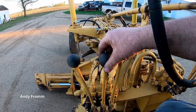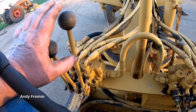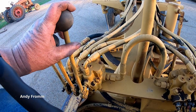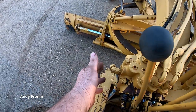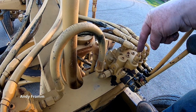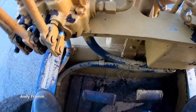The way this machine is set up: everything back goes that way, everything forward goes that way. These valves are different valves from side to side according to the parts manual, and they're kind of interesting. To me it seems like this one is set up for almost like closed-center hydraulics and this one's set up for open center, because the pump comes into here and it goes across over to this one. But they both dump their return oil straight down — this one dumps right into the reservoir, this one dumps into that hose right there into the reservoir. It's a kind of interesting system.